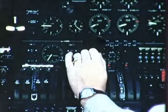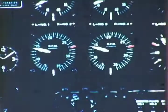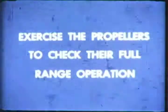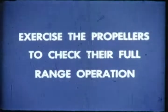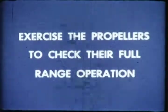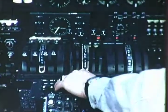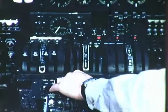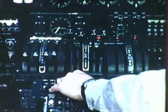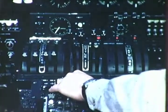The co-pilot sets the throttles of all four engines evenly. At this speed, check the propellers for full range. Check first to full low RPM, high pitch. Press the switch bar to decrease revolutions, abbreviated DEC, and hold it until the limit lights all flash on.